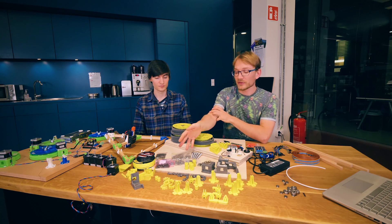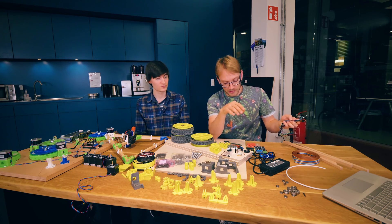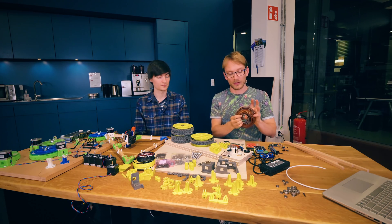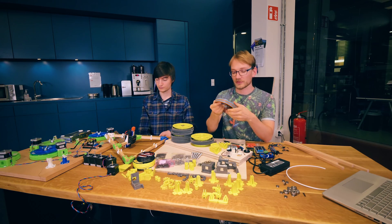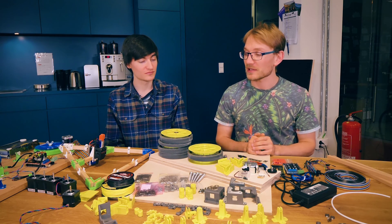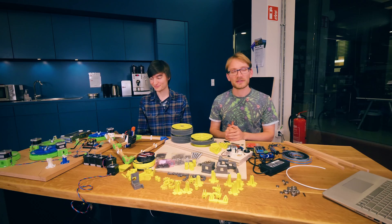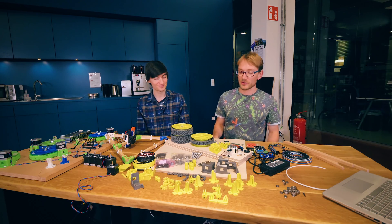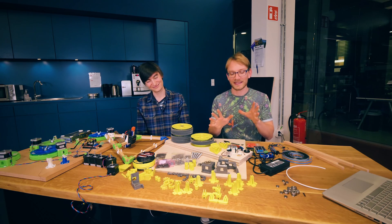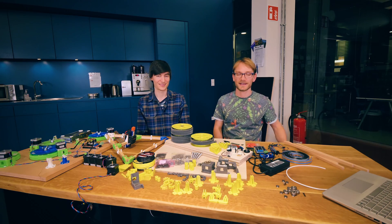The last few vitamins you'll need are standard M3 and M8 screws — the full BOM is on the website. You're going to need jumper wires to hook up the TMC2130, and some ribbon cable that connects the ceiling unit to the mover, which just hangs down. That is pretty much it — it is a really simple build, at least when it comes to parts count. The mechanical construction looks doable and achievable, and we will see when we build this thing. Come along for the ride — we will build this printer, we will get it done. Tune in for the live stream, and we hope you'll see it printing as well. Thank you for watching.